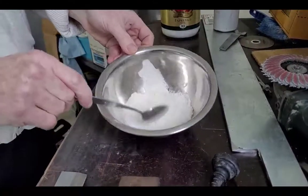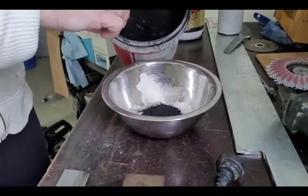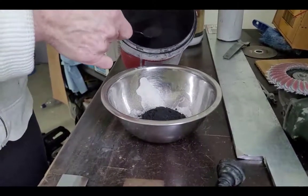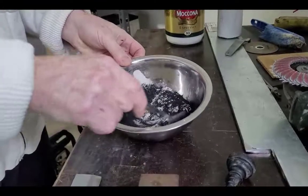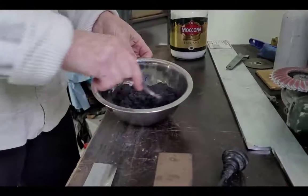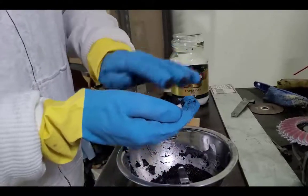Now the video that I watched called for a mixture of salt, flour and some form of carbon. I'm not quite sure of the role of the salt, but I'm assuming the flour is there to bind it all together into a kind of dough you can wrap around your steel samples. For the carbon, what I did was smash up some charcoal purchased from the local hardware shop into a very fine powder. Then I mixed these together in the suggested ratio of six parts carbon, four parts salt, and three parts flour. After mixing these thoroughly, I added a little bit of water to make a thick paste, and then wrapped it around the steel samples as you can see in the video.